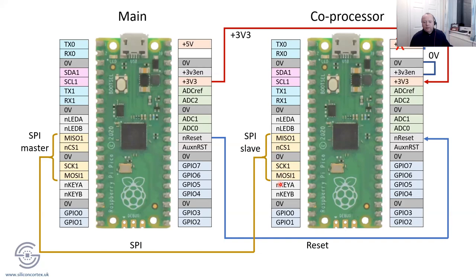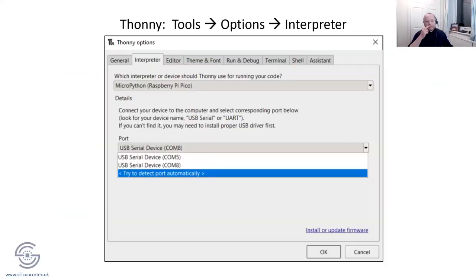So it's dead easy to wire the MOSI to the MOSI and the MISO to the MISO, which is why it's called that, because it's just easy to go one to one. It's pretty straightforward. So again, I think it's just whatever your application is, don't overthink it. We will, in a future episode, spend a bit more time looking at the SPI and the I2C, because I think that does warrant a bit of time on its own. But what I was just going to finish off with today was, in Thonny...